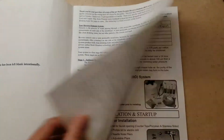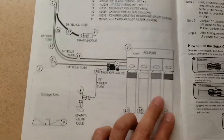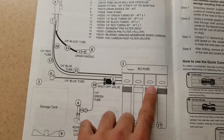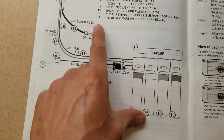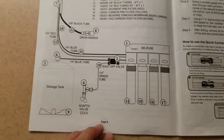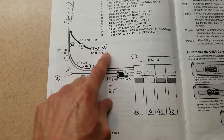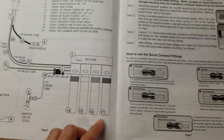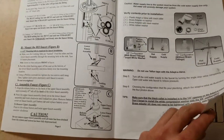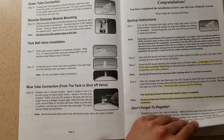I'm going to basically take out the membrane part — the green filter — which is the part that does most of the work. This is the reverse osmosis portion that filters out most of the stuff from the water, including the essential minerals. It's part number 16, the reverse osmosis membrane, and it's the green filter. Using the filter, it takes about five parts of water to make one part of drinking water, and the rest drains through the red tube. It's a good system, but the filter is very strong and makes the water taste tasteless — it removes essential minerals your body needs.